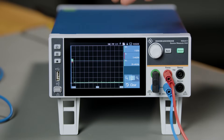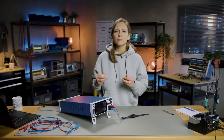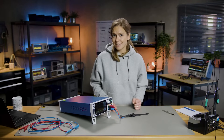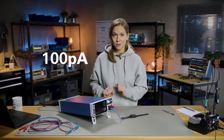Since levels of power consumption are very low during sleep and standby modes, a power supply should have high enough current measurement sensitivity to capture them. On a conventional power supply, the values you see would be zero, and you won't be able to optimize your design. The NGU power supply captures signals down to 100 pico-amps resolution, providing engineers with insights on potential power consumption optimization.